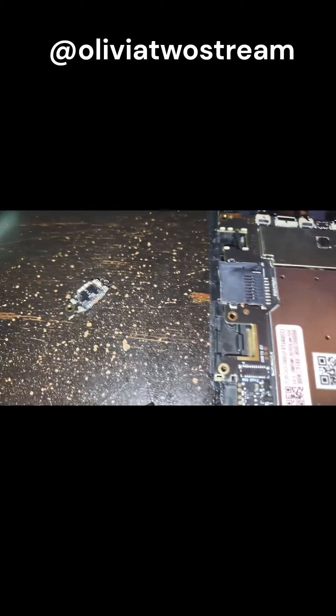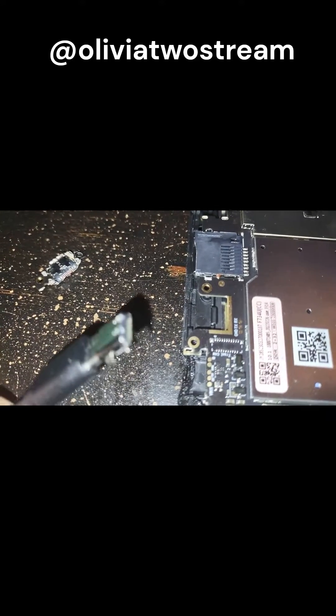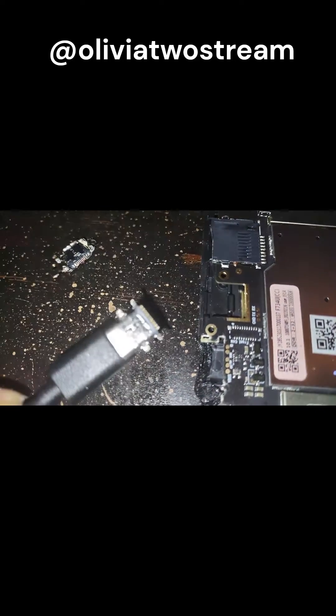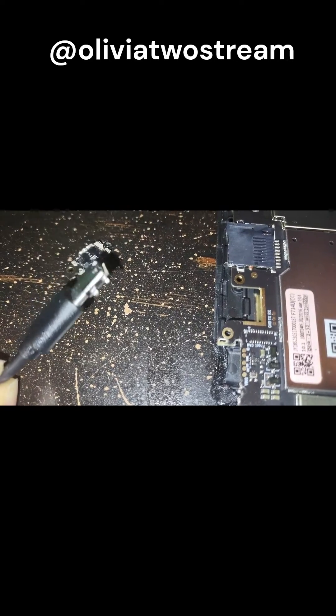As you can see, the two pieces were very similar and the exact same size. I couldn't get the bracket separated from the USB with a heat gun nor a blow dryer. I ended up using joint pliers to slowly rock the damaged USB port back and forth gently for about 5 minutes, and it eventually came off.